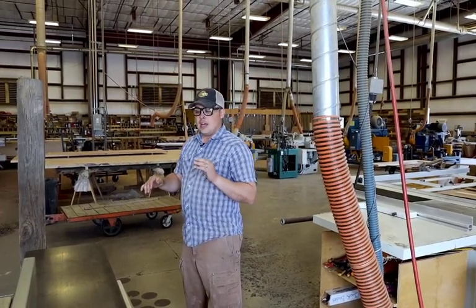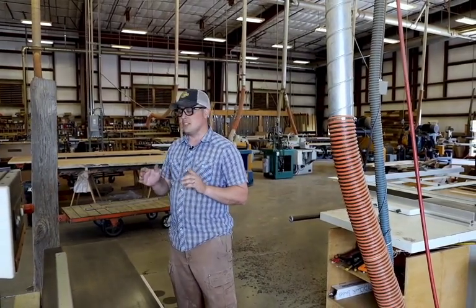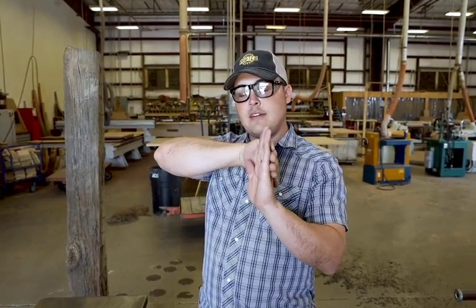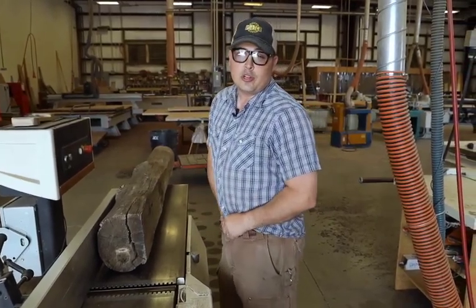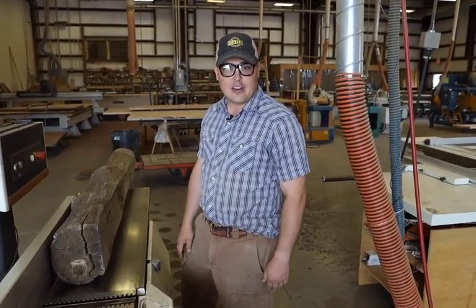For this mantle I'm going to use the jointer for two things: first to flatten the backside, which I'll probably do by eye because the mantle is curvy and moving. Then I want a nice perpendicular plane to it — I'll take that flattened side, put it up against my fence, and joint the other side to get a perfect 90 degrees. From there I can take it to the planer. When you're around a jointer it's a really great idea not to have long hair, a necklace, or loose clothes. Woodworkers were the original inventors of the shirt tuck because they don't want to die.